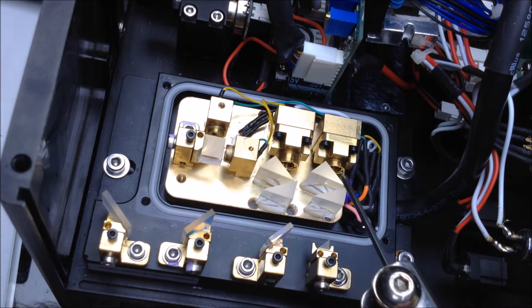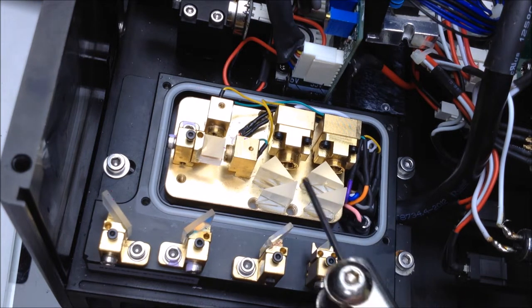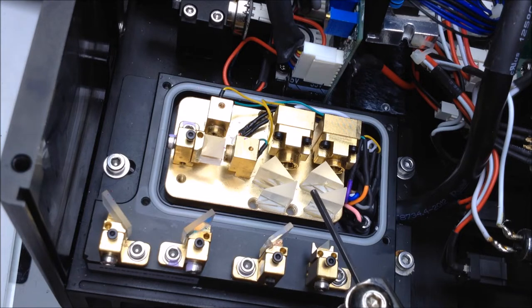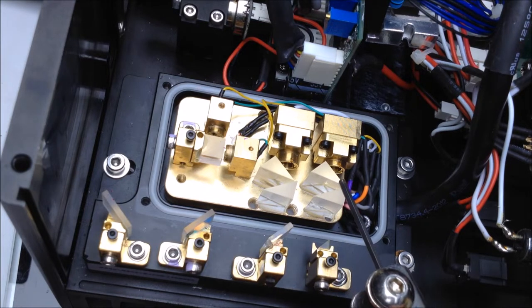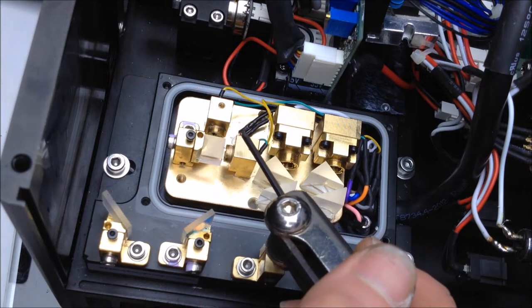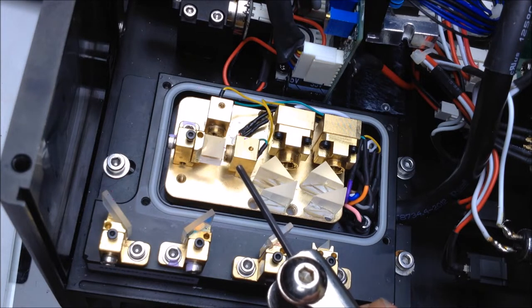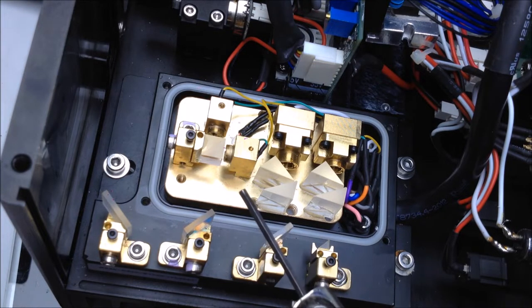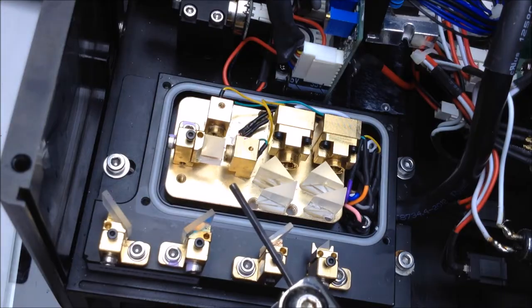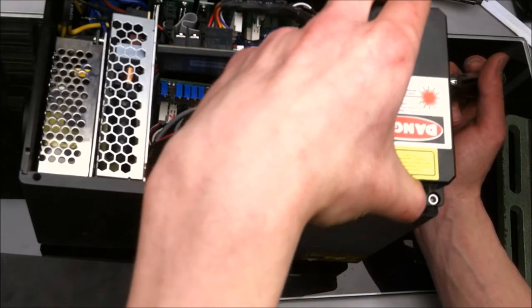Interesting. Excellent beam correction. So on these you can see the anamorphic prism pair. And these 2 prisms, they correct the beam output. You can also get correction lenses, and here I'm assuming they're using one of the 650 high output laser diodes and a polarized beam splitting cube. So pretty straightforward assembly. Put the cover back on carefully.